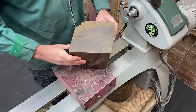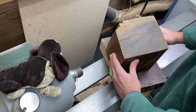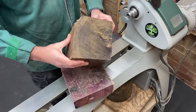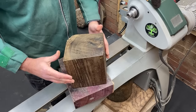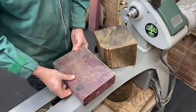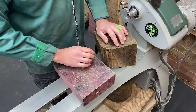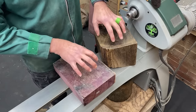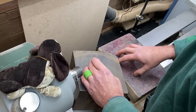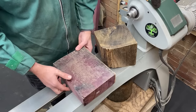Now what we're going to be making is something to start off the year with a bang — we're going to make a mallet. This big piece here is obviously going to be the business end, the part that does all the destruction, and the Purple Heart is what we're going to use for the handle. Both woods have a very similar weight and density so they are going to be quite compatible and hopefully we'll end up with a nicely balanced piece. We're not going to be drilling all the way through — instead we're going to use a Blind Fox Wedged Mortise and Tenon joint which should hopefully keep the handle in there nice and sound forever.